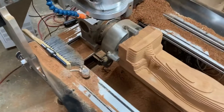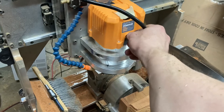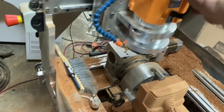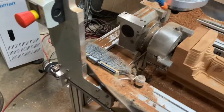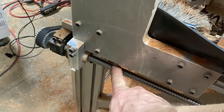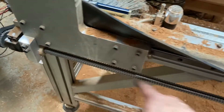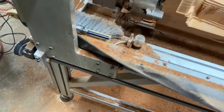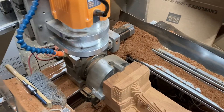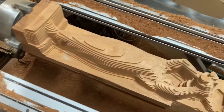So the course of action: I have ordered a new spindle — an actual spindle. I ordered a 7.5 kilowatt air-cooled spindle with a VFD vector drive. I also ordered 20 millimeter ball screws instead of 16 millimeter, and 2010 pitch — 10 millimeters per step — so they wouldn't spin as fast and I can achieve greater travel speeds. Once everything comes in, I'll keep you updated. If you like what you see, don't forget to subscribe. Have a good day!